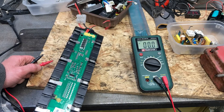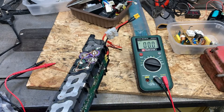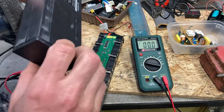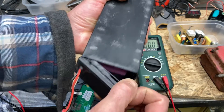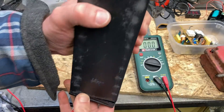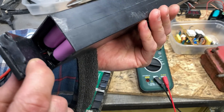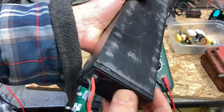It should be 41 or 42 volts when full, so contrast that to this battery pack here - this is a Le Top, found in a different scooter. The end pulls out, I've had this one open before - I'd be cautious about this one. It's the same thing but arranged differently, and I presume it has a BMS in it as well.